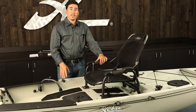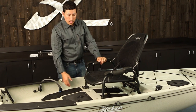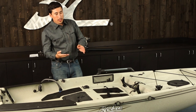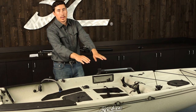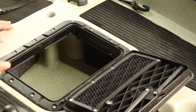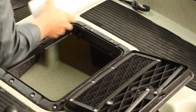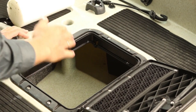We're going to need to access the inside of the hull. Before I get started, I'm going to take my seat out because it's going to get in the way, and then I'm going to pull out some foam from the inside of the kayak in order to get just inside that crank. I'll need to remove the lines off the crank and lay them flat on the bottom of the hull. The best suggestion is to remove this rear block and then this cylindrical piece of foam as well. Remember where they go because you'll need to put them back in the same way.